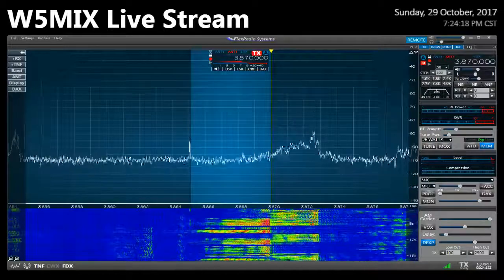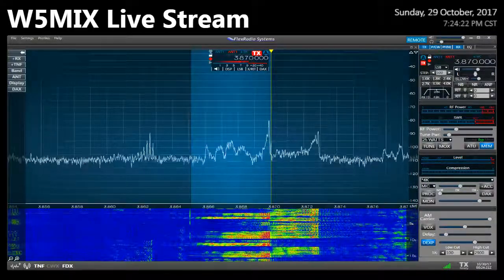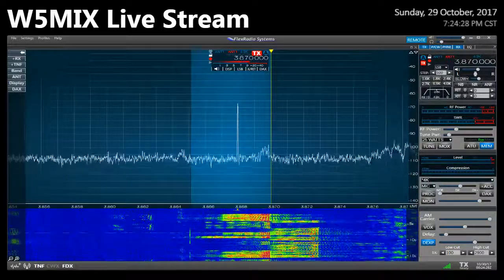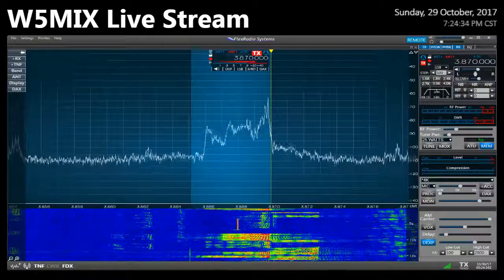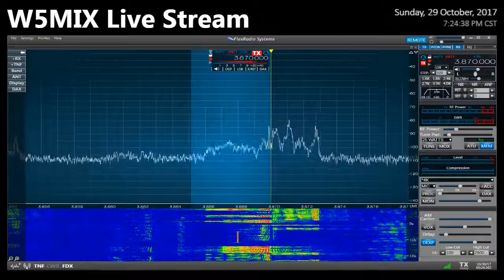There, that ain't better? There you go. Marginally better. Now, if you put about 500 behind that, double whatever you got coming out of it. It's still only putting out about 80 watts, but at least I got the SWR down to less than 4 to 1. Well, quadruple it. 4 to 1? Yeah.